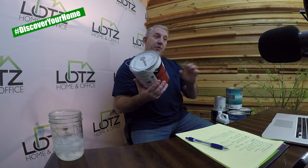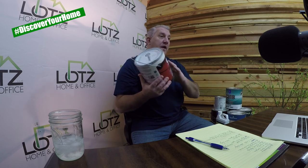It's clear, which is kind of nice for do-it-yourselfers — if you get a little on the trim work you probably won't notice it. But if you're in an area with a countertop or cabinet and you splatter all over it, make sure you get it cleaned off because when this stuff dries, it's tough to get off. When you have issues removing wallpaper and it bubbles on you, this locks it down, locks the paste down, keeps latex-based paint from re-wetting the paste on the wall. Excellent product — you can find it at paint stores and big box stores.